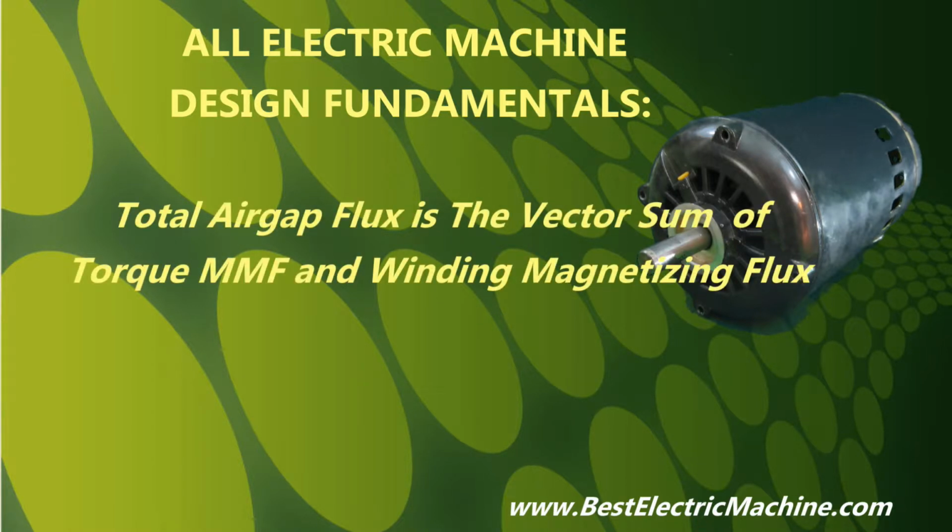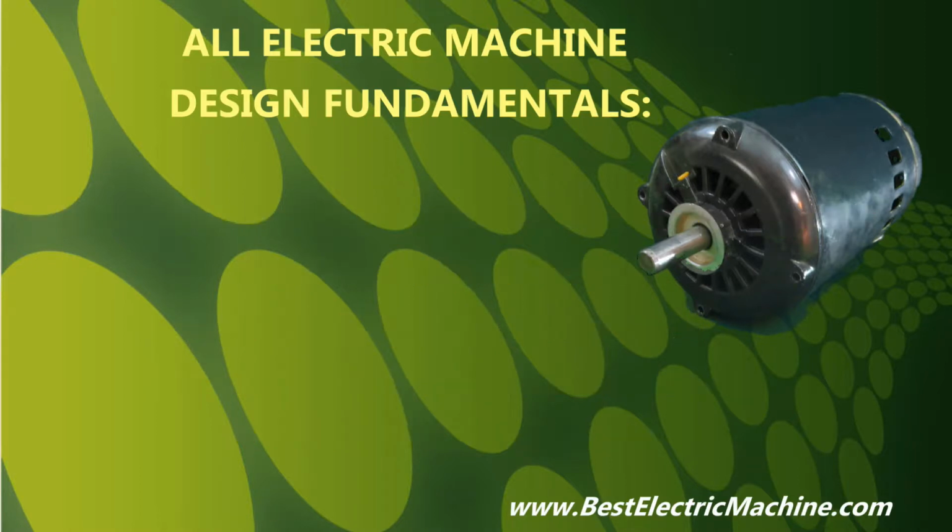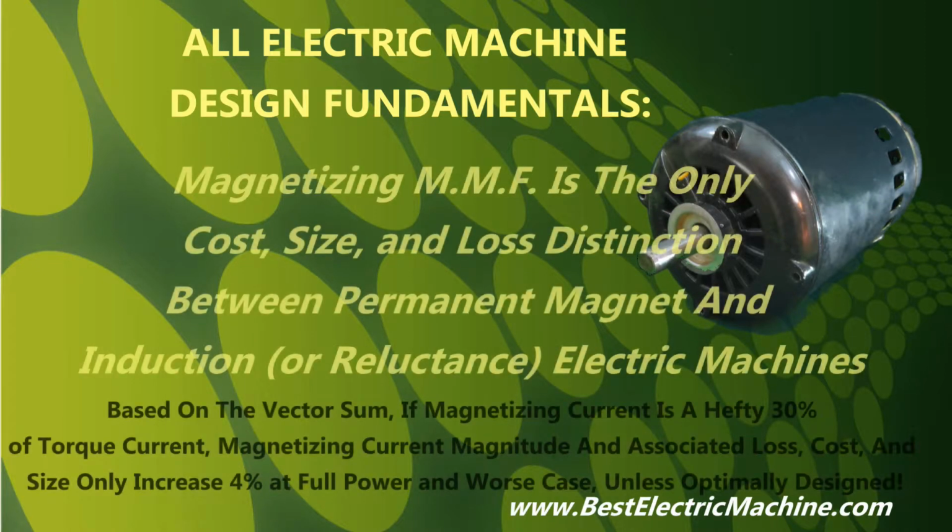Total air gap magnetic flux is proportional to the vector sum of the torque MMF vector and the magnetizing flux vector. With all electric motor contestants optimally designed and without considering the extravagant expense of rare earth permanent magnets, magnetizing MMF is the only cost, size, and loss distinction between permanent magnet electric machines and induction, or reluctance, electric machines.